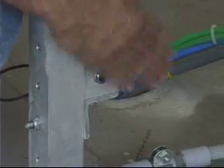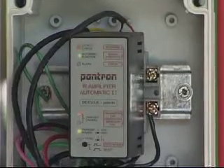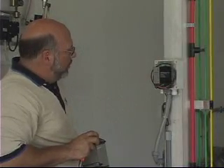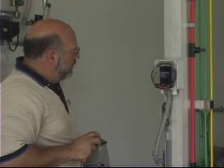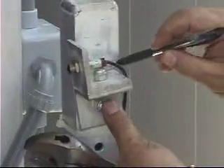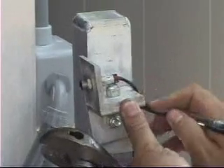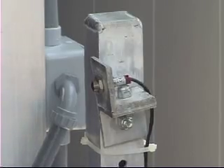The eyes are lined up, and as we block them we do get a signal. Pressing the test button, we count up to 8 — so we're actually a little better than we were. Before we tighten them up, we can take a pen and make a line right where we are so that we try to keep that position still while we tighten them.